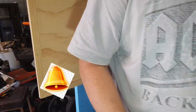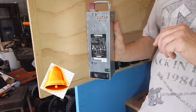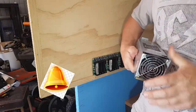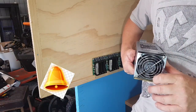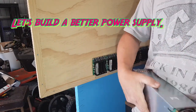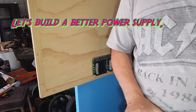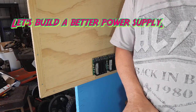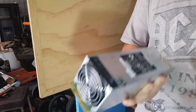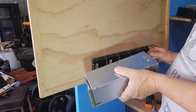What I'm going to do now is I have a couple of these ESP127 compact server power supplies. I'm going to do a bit of shorting on a couple of pins because I found somewhere on the internet how to short it out to get the voltages. Apparently the five volts is on the back and it should be 25 amps. I'm going to use some XT60s to connect to so it's nice and neat and compact, and I can remove it when I want.